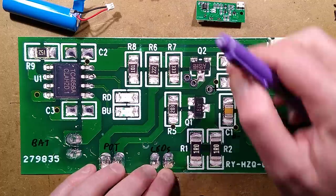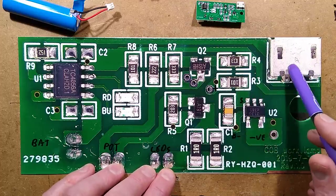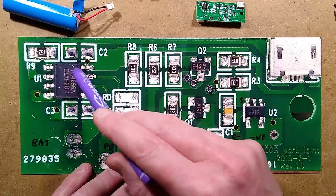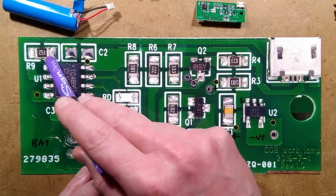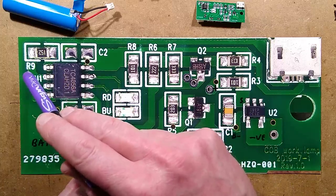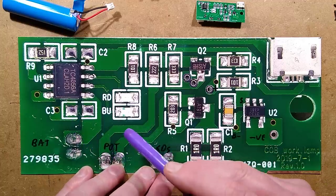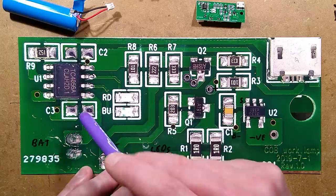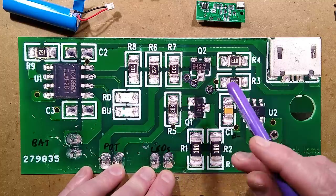So look at the circuit board. We have the USB port here for plugging the charging supply, and that pretty much goes straight across to the 4056 chip, TC4056A, which has one resistor, 152, that's 15 followed by two zeros, 1.5 thousand ohms, and that sets a charge current of approximately 780 milliamps. There are two positions for capacitors, which rather naughtily should be occupied, but they're not occupied. Maybe they've had problems with ceramic capacitors going kaboom.